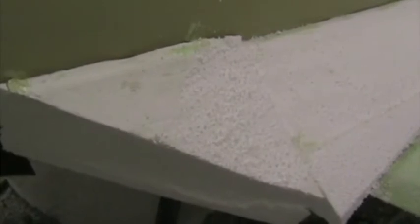The front block is not yet in position. I must still cut the hole through it to allow the wing pin to be extracted. Here I'm busy shaping the wing root fillet. I've taken scrap foam and bonded it in position with micro, and I'm starting to shape it with a rasp. Ultimately, we'll probably offer this in the kit as an option, as a pre-molded wing root fillet. But this is one way of making it.